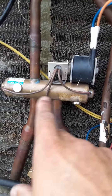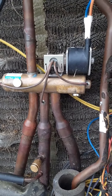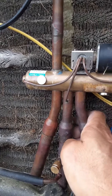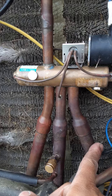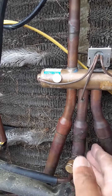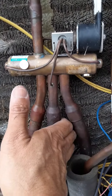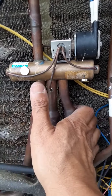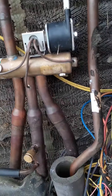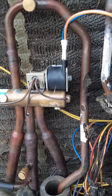See that magnet move. I've got two magnets on it. So right now it's back into the cooling mode. You've got two lines — one coming from your evaporator and one going back to your compressor. These two lines here are always the same temperature. You can use an infrared thermometer but you don't have to. They're always the same in the cooling mode. That's how you check a reversing valve for proper operation.